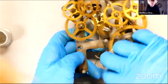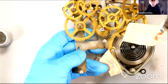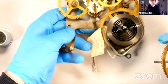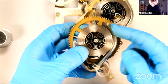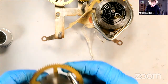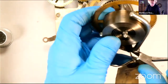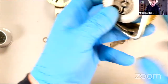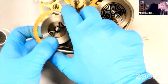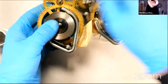This is our striking mainspring in place. Let's just pop the going one on. Right, okay. I put the clip on the wrong side when I was winding the springs. That long piece should have been on the outside. Now, is that going to cause me a problem? Yeah, the spring is on the correct way round. I wonder whether that's going to prevent us from actually getting that thing together. Let's take a bit of string off. Sneak that down. There we go.